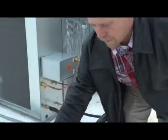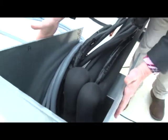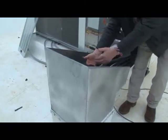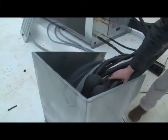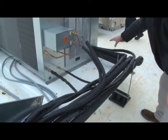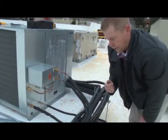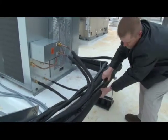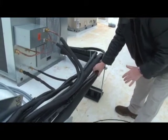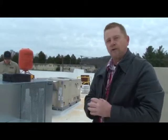Note the nice inverted traps once we come through the pitch pocket. This is the pitch pocket — a typical pitch pocket that you'll see at a job site. Suction lines are coming up, they have inverted traps at the top, and then the remainder of the suction line slopes down toward the compressor to help with the oil return. Note that both the suction line and the liquid line are insulated. Both lines must be insulated when utilizing a reverse cycle defrost system.